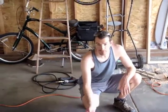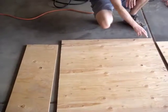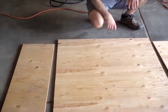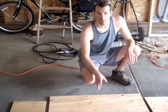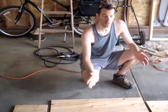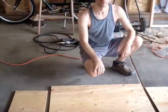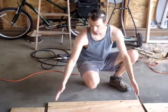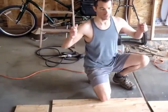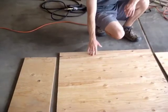We've got three of our pieces of plywood cut for the main box. This piece is exactly 36 inches by 48 — 3 foot by 4 foot — the exact same size as the piece of plexiglass. If you remember, we cut the top box so it's a little bit bigger: 1⅛ of an inch bigger on all sides than the plexiglass, so that opening going over the top of the box is slightly bigger. That's why we cut this exactly the same, so our cover is slightly bigger than this — 36 by 48 inches.